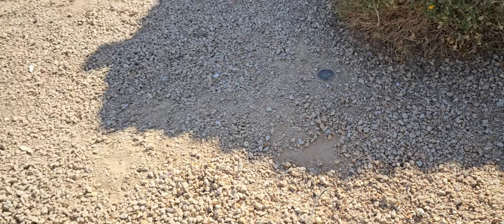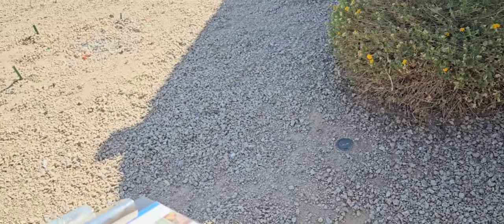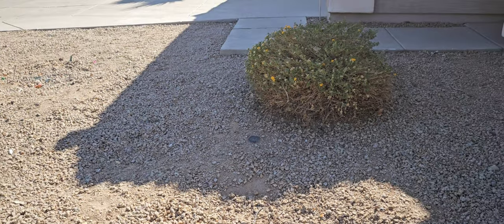There was a tree here and a tree there — I know it was a tree because there are fence posts from where they tried to tie it up. Your drain system goes underneath your property out to the street. I'm a little concerned about your drain system under here with all the roots that were in here at some point. The client did not order a sewer camera inspection today, so I'm not doing it — I'll politely recommend it. It's a 20-year-old house, it's up to them.